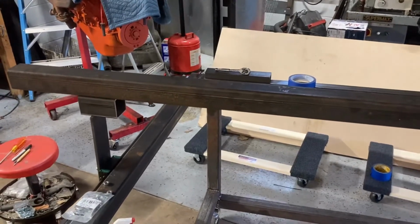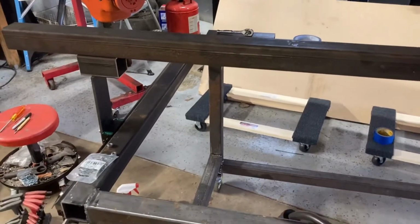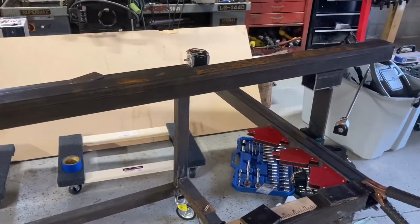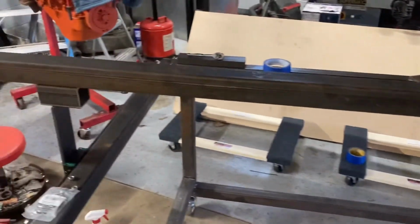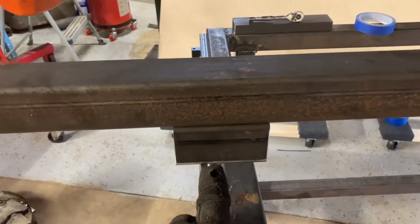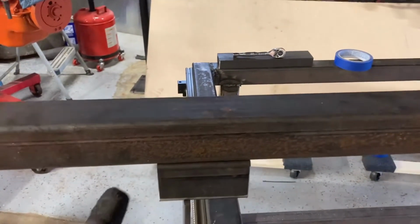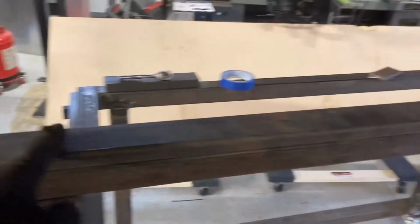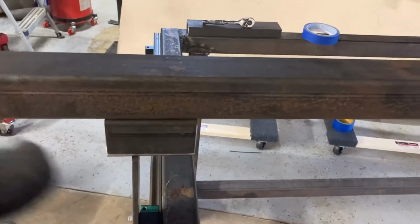I just didn't want to design it super high up because, obviously, it's going to add instability to it because of racking, and also just obviously the higher it is, the more momentum it's going to have. So I want to keep it relatively low, but I think just those 2-inch pieces will be good, because then what will happen is we'll weld these on to the uprights, and then we'll drill them and tap them, and then we'll have bolts accessible from inside the 2x2 that go up into the gantry beam, and then those can be adjusted through the threading or by adding shims.